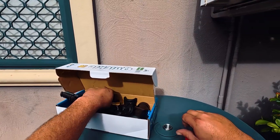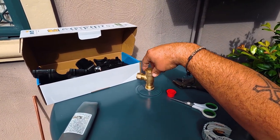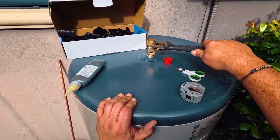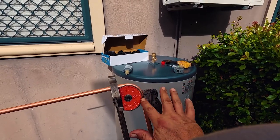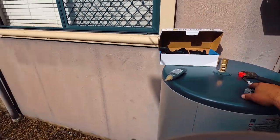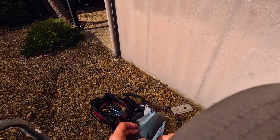Now for the hot water outlet. Fix that into position and it should be okay. These are half inch benders — get it right down there onto the 90 degree mark so you've got a perfectly straight bend. Lagging on again because this pipe will get hot and even burn you if touching.